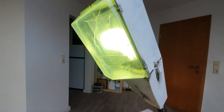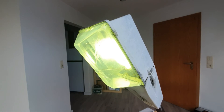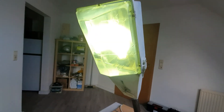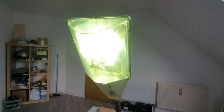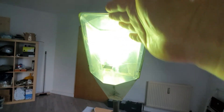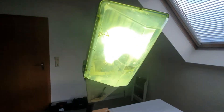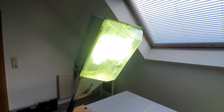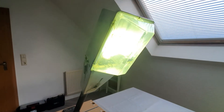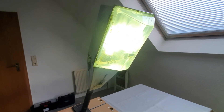As the fixture warms up, you can see this reflector does not concentrate the light the way a reflector shaped around the bulb would — it's more of a wide spread angle. It's a really old design by Siemens; later they also introduced a reflector shaped around the bulb, the classic style. But they continued selling this wide-angle version until almost the end of production, and interestingly you could choose which one you wanted. As the bulb warms up, the ballast gets a little quieter, as is often the case with older ballasts.